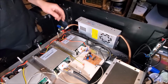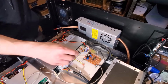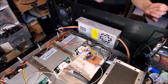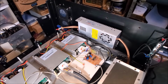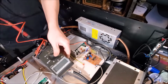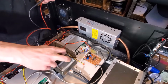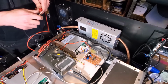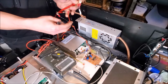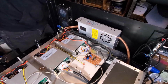So now I have to connect the main wires right here, and I also have to connect the wires right here. I'm going to do a sanity check before I do that. Crank power through there, see if I got my P's and Q's crossed. It's meter time. Alright. Power ground and the signal ground should be connected. Okay. Power ground, signal ground. And they are. Nice. Okay. Awesome.